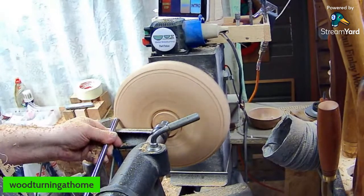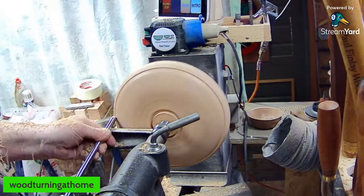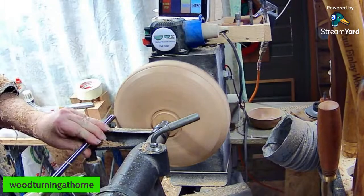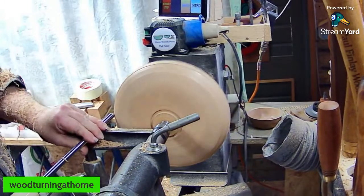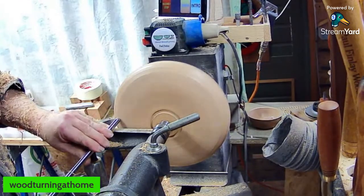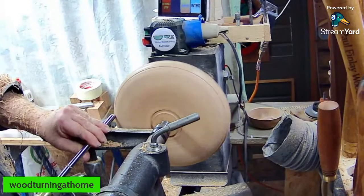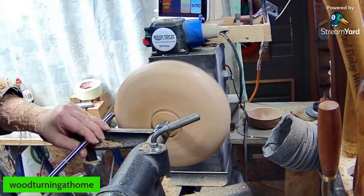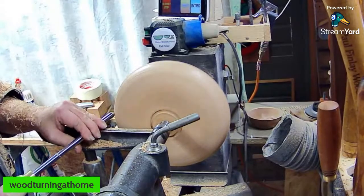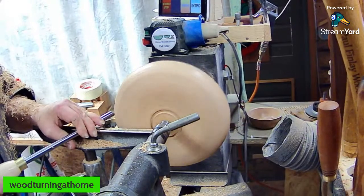Now I'm just going forward in a push cut. I'm picking up that cut where I left it off. And I can tell this gouge is just not helping me any. I do need the wings ground back on it and to profile it correctly. It wants to catch and I'm not getting the same flow I would have off the other one, you know. Yep. And you will find that from time to time, especially when you buy a new tool.